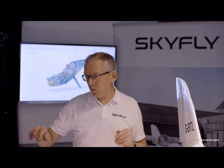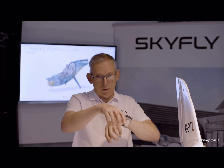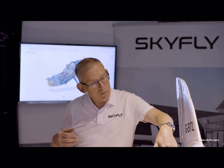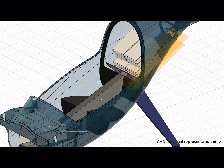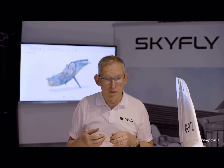There's quite a demanding load case on this kind of aircraft because it's similar to a drone. You've potentially got the situation where you've got maximum thrust on this rotor and maximum thrust on the diagonal opposite corner, and that puts a large torsional moment into the fuselage. So the fuselage has frames that take this torsional load from the wing into the fuselage shell, and then the fuselage shell has a central spine or tunnel in it, which acts as a large diameter tube — very good for resisting torsion. That's the way the structure works to keep it stiff.